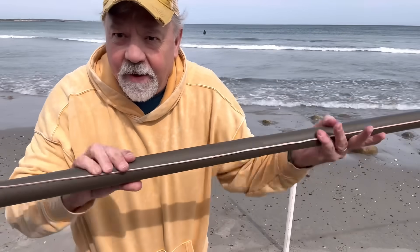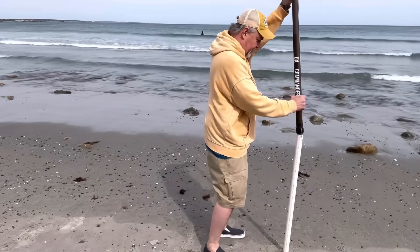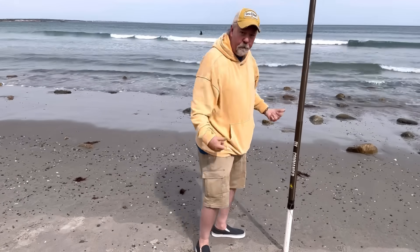Now that I have the pole fully extended and the driven element cut, I'm going to start taping it at the bottom. One thing I know from experience is when I slide this on the PVC pipe, I have a lot left over, so it doesn't go all the way to the ground. Maybe 100 millimeters, 4 inches or so, is where I'll start taping this thing to the pole. I usually go straight up. Some people like to twist it around thinking it makes a difference — I've found that it doesn't. So what I do is just about every meter or so, take some simple black electrical tape. If you're American, you can get it at the Dollar Tree for a dollar a roll. Wrap it around, pull it, boom, and it's on. I'm going to tape the rest of this on the pole all the way up to 25 feet or 7.6 meters. Now that I have the wire taped to the pole — I usually like to tape around the joints too — I'm going to slide the pole right on the PVC. Boom, there it is.